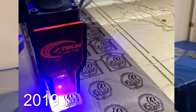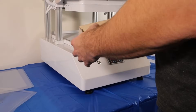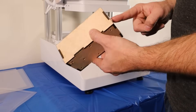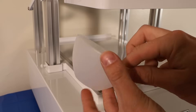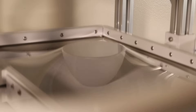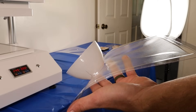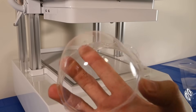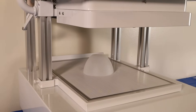So like when I got a laser at first, I just didn't know what to do — I knew I wanted to laser everything. But the more I work with it, the more I realize what it can be used for. I could even make a jig like a box like this that would make it easy to cut a straight line on this piece of plastic to make it look more professional. I used one of my kids' food bowls and drilled the hole through the bottom. I didn't realize I was encapsulating it a little bit too much, so the draft angle is absolutely in the wrong direction. Can you see how clear that is? That is how I should have done it — that's the draft angle we want. It came right out.